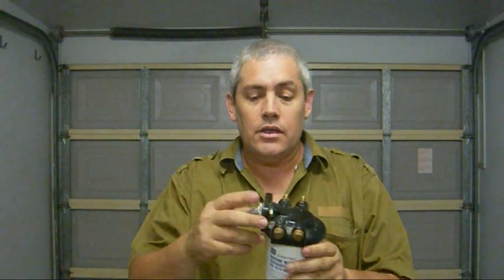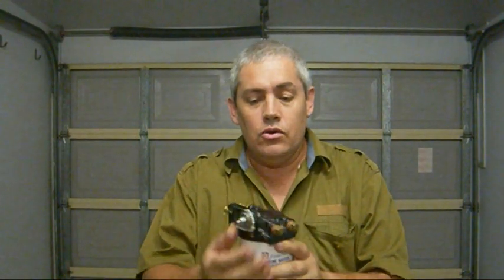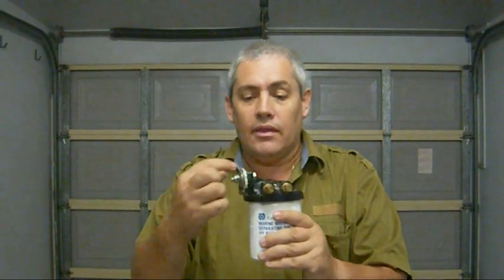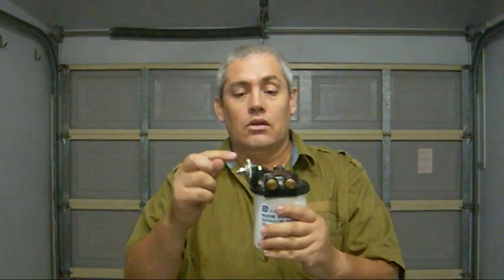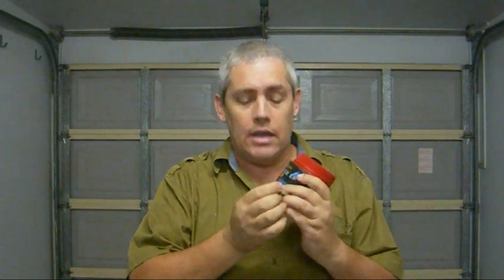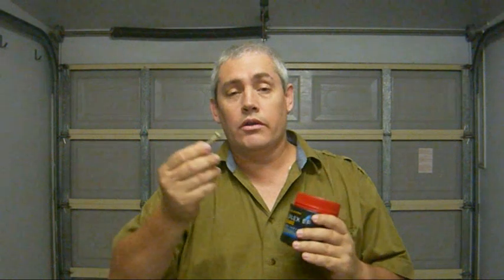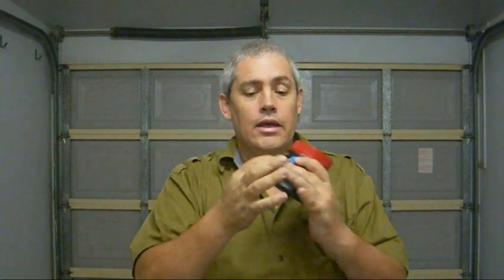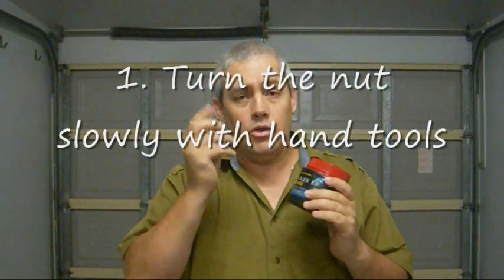So how do we fix it? Well, in the case of this one, there was no fixing it. Mounting a fuel filter up into a tight space, out of the way, hidden — nothing. It galls. How do I get a hacksaw in there to cut that? Couldn't do it. That's why I had to cut the fiberglass — just used a Dremel, small enough to get in there and cut it and get it off. The mistake I made was because it was in an awkward spot, I was actually using a power drill to apply the nut onto the bolt — and that's a no-no. If anything's going to make galling occur, it's trying to do the nut up too quickly. I should have laboured through it, doing it up by hand.